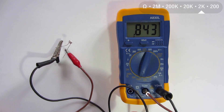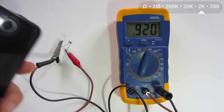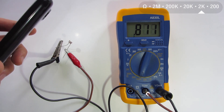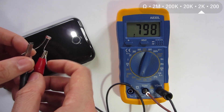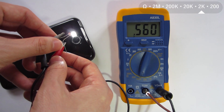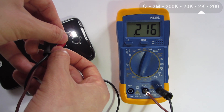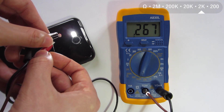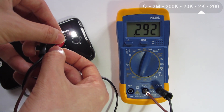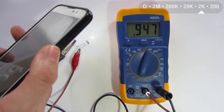For bigger precision, I change the scale back to 2,000 ohms. Now I'm going to use a flashlight to change the resistance. When I approach the light, I can see that the resistance starts to decrease — around 800, 500, 400. And when I approach the photoresistor even closer to the light, I can make the resistance go down to 170 ohms. And when I take out the flashlight, the resistance goes up again.